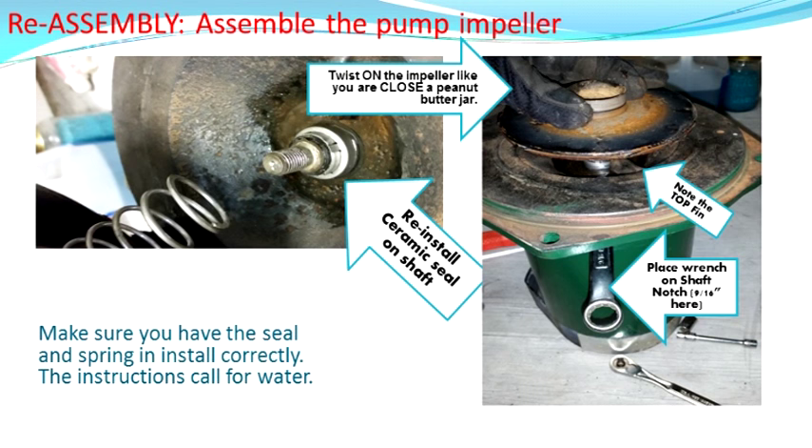Now that the ceramic ring is in, we're ready to put the pump housing ring back on the pump. This is another alignment opportunity — look for your markings. On mine, the big square wing on the top indicated where the bottom was, so I aligned that with the bottom of the pump and put my four screws back in. At this point, put the spring and the pump impeller back on. The other ceramic seal — the new one — was a little tight going on, so I put some lubricant and water, as the instructions call for, to make sure water is present when putting the whole assembly together. Put your wrench back in on the shaft, put the impeller back on top, push it down, and close it back up like a peanut butter jar. Don't strip it — it should go on easily and twist right down to the bottom, then snug it up by hand.